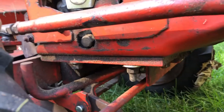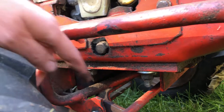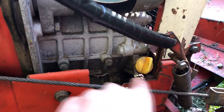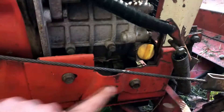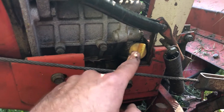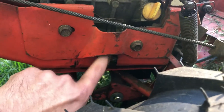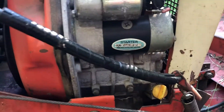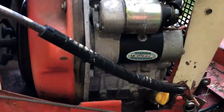The oil drain plug sort of lined up, but I did have to make some additional cuts under that. I had to modify the front part of the frame — the front frame — and notch that out in order to access the oil fill and no longer use the original drain hole. That was about the extent of the modifications to the frame. It wasn't too bad thankfully.